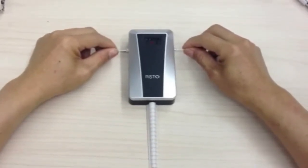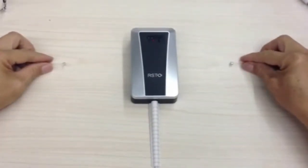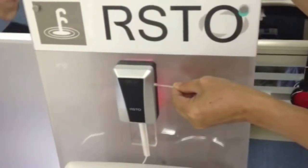Remove the pins when the sensor is flashing. Nobody should be in front of the sensor when it is doing the learning. To set heavy and light flush, place the magnetic pin on the right side to set light flush.